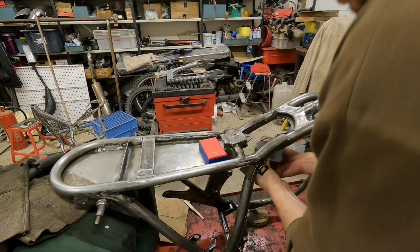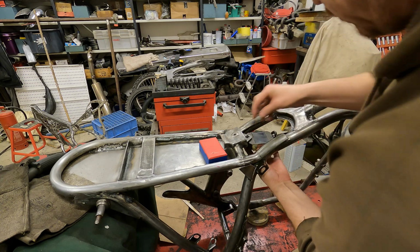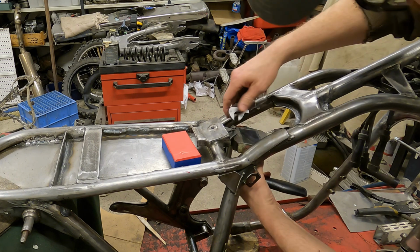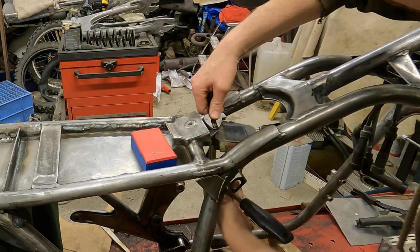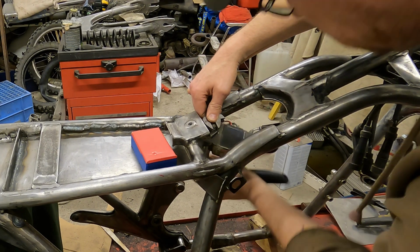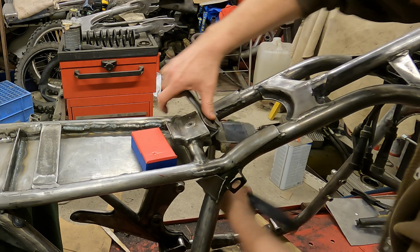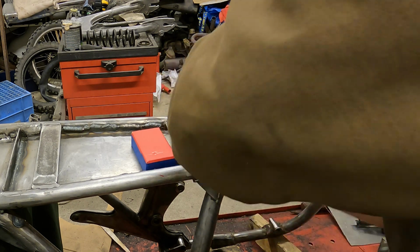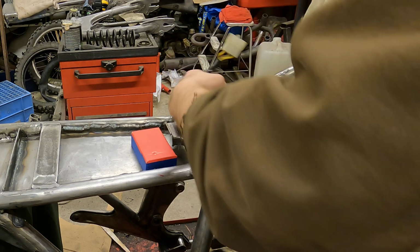Today we continue the Honda CB750 Cafe Racer build. First I make a bracket for the regulator that goes under the tank. Then I make a small raising piece, a tank mounting bracket for the back of the tank. The intention is to make it such that the tank does not need to be modified. The purpose is also to use the original tank holder rubbers.